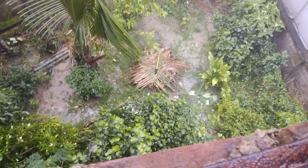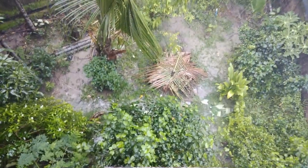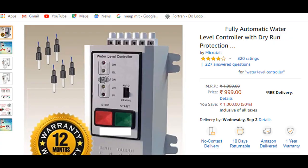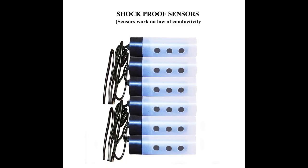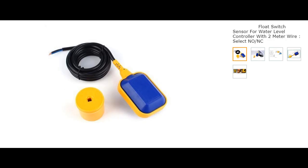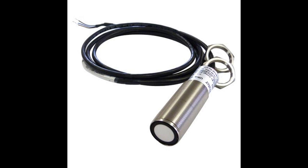This is my house tank overflowing, and in rainy season it is very difficult to understand whether the tank has overfilled or not. Normally a conductive type water level sensor is what we used in the past, but its electrode gets eroded with time. Another form of water level sensor is float type mechanical switches, which can get jammed.